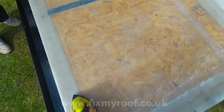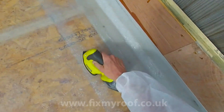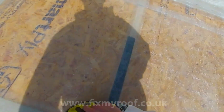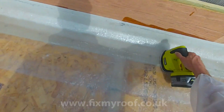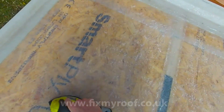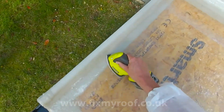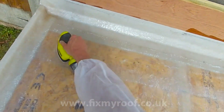This will either remove or highlight any slight raises in the laminate by turning them white. Now because it's easier to see, I can choose whether to sand it further or not. Pay a little bit of extra attention to laminate overlaps or trim edges. It really is as easy as it looks, and one or two people equipped with these sanders can pass over even a very large roof quite quickly if required. It really is a great little cordless sander and the replacement sanding sheets are very cheap.